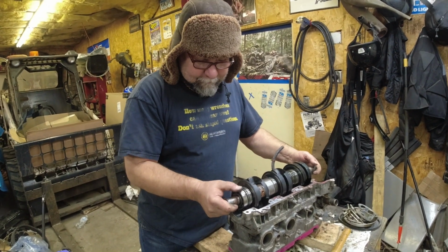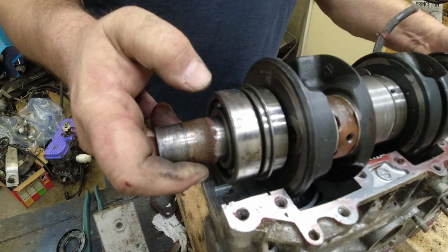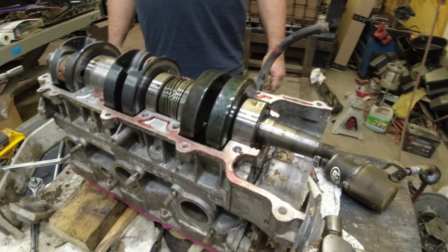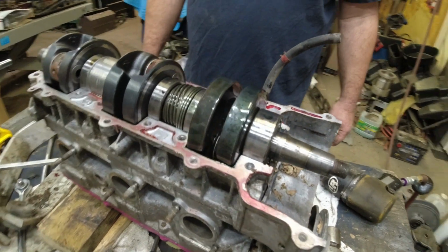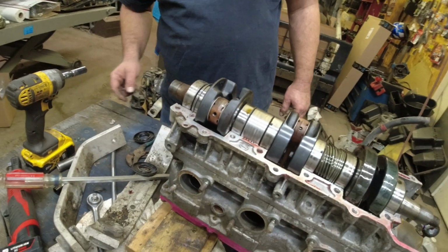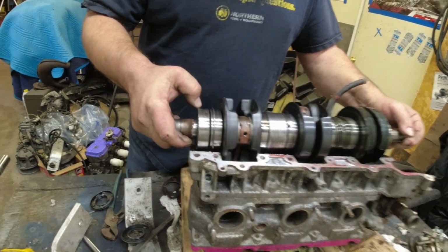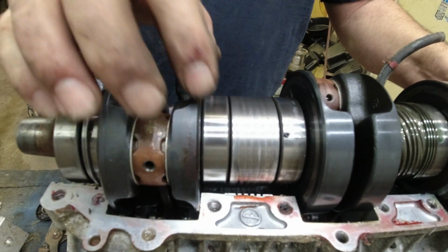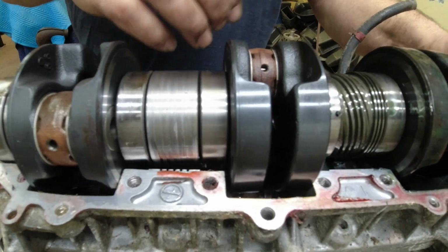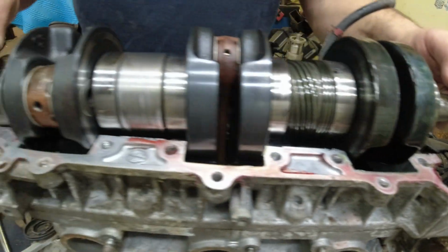She's a goner. She's no good. Damn it. Yeah, SOL. Bad crank. Needs new bearings. No more usable than the one Dennis has. I mean, there's no chunks out of it. Yeah, the seals look good. But she's a goner. Like, they probably rebuilt it, just put new seals on. Yeah, they just resealed it. They didn't rebuild the crank. I mean, that ain't good. And even as we get down the line, that's still pretty noisy. That one's mega noisy. And then as we get to the mag side, they get better, just like always.